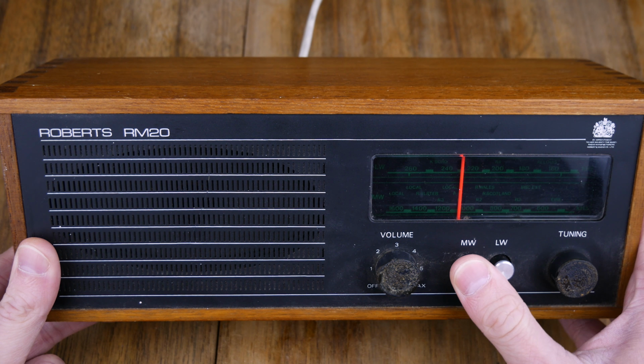And then we've got this on-off volume control, and I think I'll try and keep that, at least for the on-off switch. I'm not sure how I'm going to do the volume, because this is going to be a different setup than I'll want for the amplifier that I'm going to use, which is probably going to be a PAM8403, just because they're nice little amplifiers.